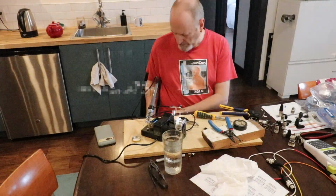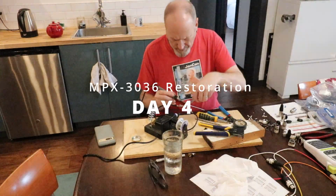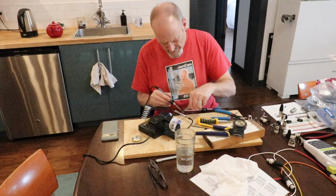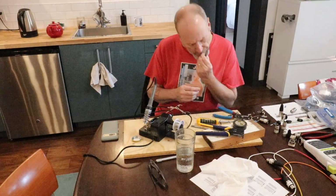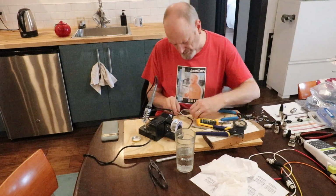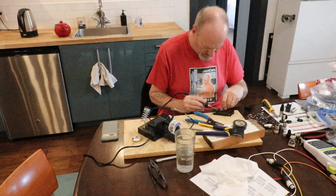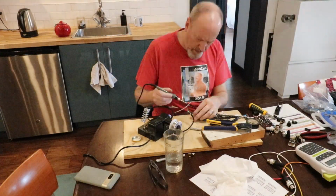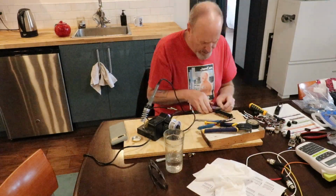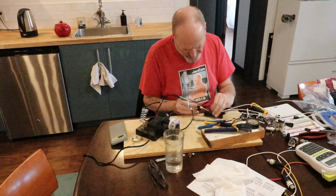Next morning I got to making some more cable connections. So I had a whole bunch of leftover XLR connectors from building the studio. Some of them were wall jacks, some of them were cable ends. And I got the two-shell connectors and sorted them out and got some blanks, and then did a whole bunch of soldering to get 4 microphone cables connected to one of the two-shell connectors, and that way I could start testing channel strips. And in doing so, I would be able to do banks of 4 at a time, move the two-shell connector over to the next connector, and then check the next 4. At least that was my plan.